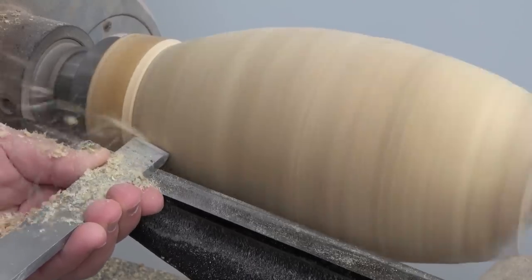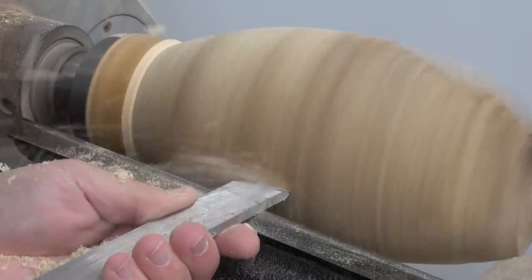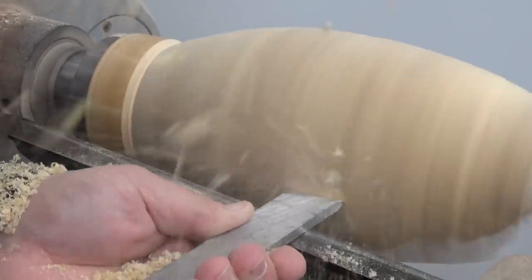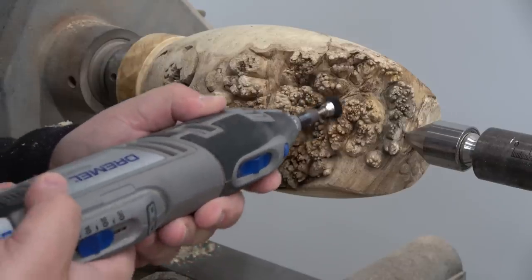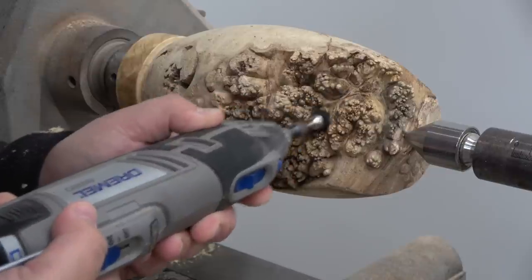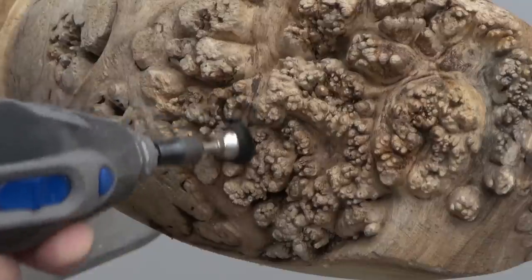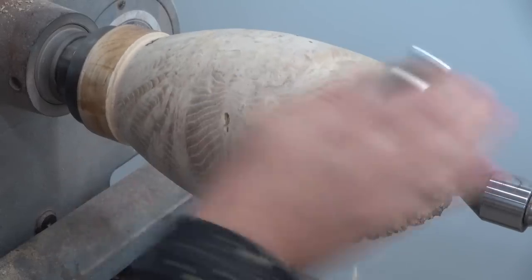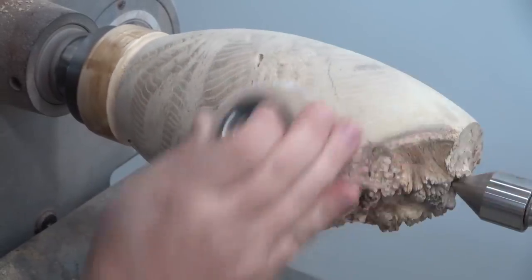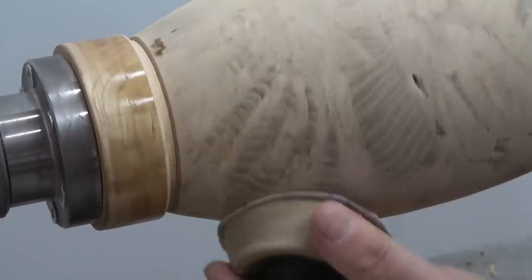Once we have the desired shape I switched over to my skew chisel, which removes tool marks from the gouge. This is a super satisfying moment — you can see all the vertical lines slowly getting carved away, which means less sanding to come. Then just a little cleanup with my Dremel tool. I didn't have the right attachments and this was just a soft fiber kind of attachment, but it still did a really good job getting into the tight corners and removing some of the dirt. With most tool marks removed by the skew chisel, very little sanding was needed and I took this piece all the way to 240 grit.